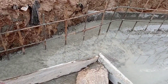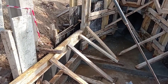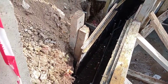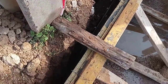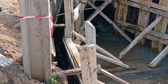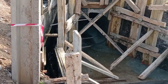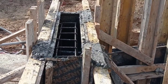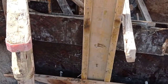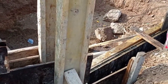You can see the reinforcement bars of our wing wall and retaining wall — for this purpose we use Y12mm bars. We have placed the formwork for our wing wall, retaining wall, and the head wall. We were just going to construct the wing wall of the culvert, but we realized that without a retaining wall there will be soil erosion, so we increased the length of our wing wall to make it serve as a retaining wall. For the head wall we also used Y12mm bars, and for the rings we use Y10mm bars. The formwork is joined with the help of tie rods.